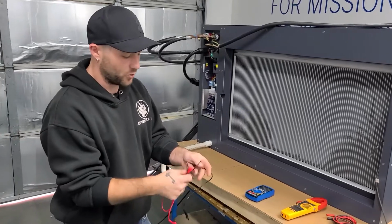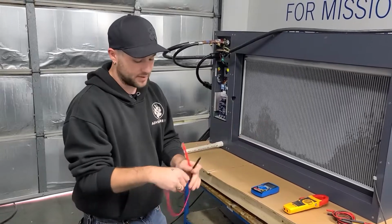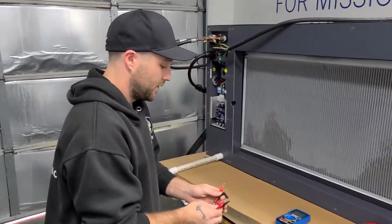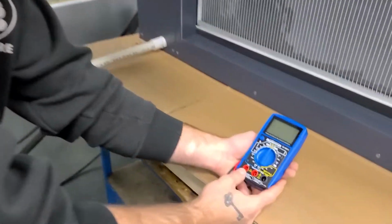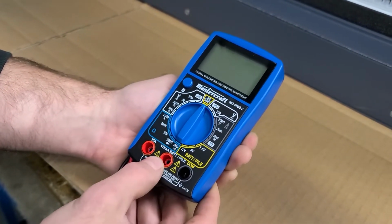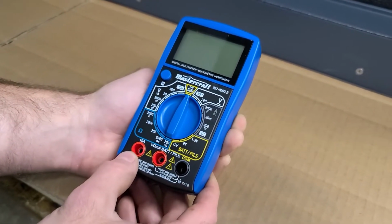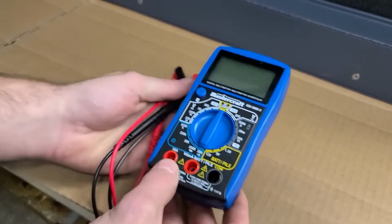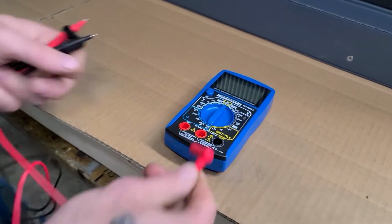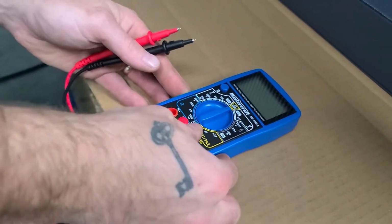These leads or probes are color coded and have a probe end and a plug end. If you follow me over to the meter, you're going to have typically 3 contacts here, or 3 plug ports. We have a common, which is almost always black, our voltage, ohms, and milliamp settings, and our large 10 amp setting. Typically you'll never use this left 10 amp setting, and you'll make sure that you go into one with the V. So we're going to plug our red plug in there and the black one into the common. Make sure they're pushed in good.